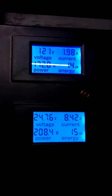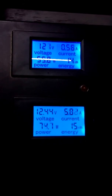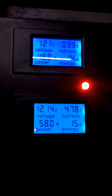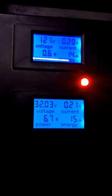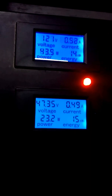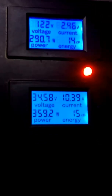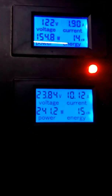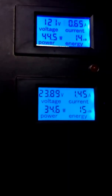The system currently — the light went out — so it's now in the 10 to 30-volt inverter. And you can see the power I'm pulling out of it. The wind switch switches at 10 miles an hour; that's when the red light goes on and we're back into the 22 to 60-volt, 1,000-watt inverter. So as the wind speeds increase, we allow the voltage to go up and the amperage drop, going into the bigger inverter. This keeps repeating itself depending on the wind speed, so you've got a great array of power to collect.